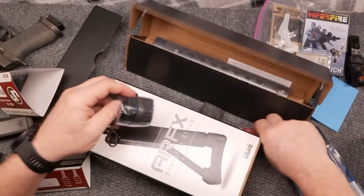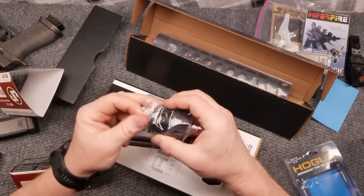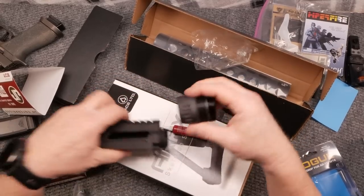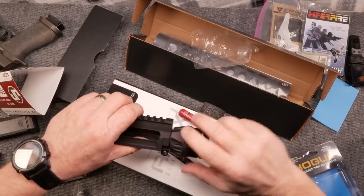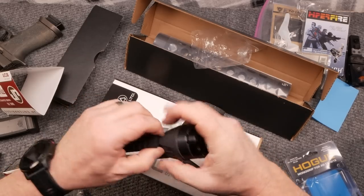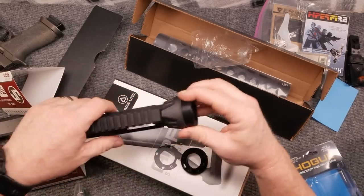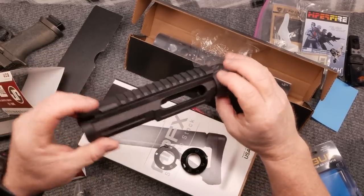I love the barrel nut hook on the Mark 3, which is why I've got the red Loctite here. While I'm out of town waiting on the barrel, this system has to set up on the upper receiver using red Loctite. Someone asked me the other day if you really need to use red Loctite - and yeah, you do, because it's all about the system. This is in my opinion the best hand guard system out there. You put the red Loctite on, let it cure up, then this section comes out and your barrel screws right in with the barrel nut.